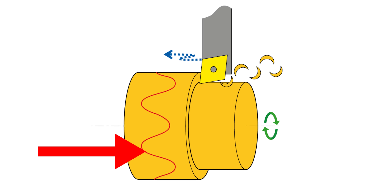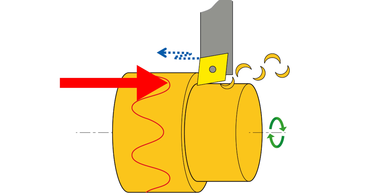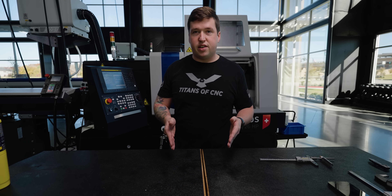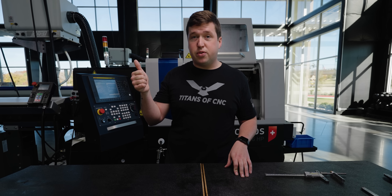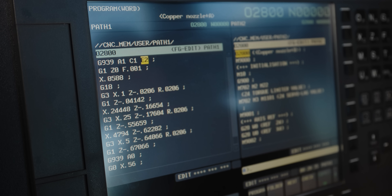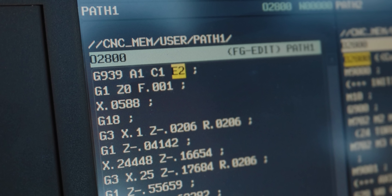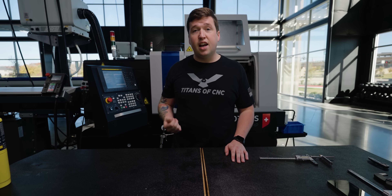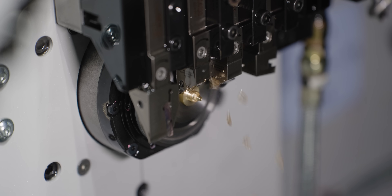I have a C1 in this program, which means it's going to take one and it's going to multiply it by my feed rate to create the size of the oscillation that it's going to do to break the chip. The lower you go on these parameters, the easier it is on your machine and the better finish you'll get. If you jack these parameters through the roof, your part's going to look like crap. The next variable is your E variable — that is the direction you're going to oscillate in. You can oscillate in X or you can oscillate in Z. X is one, Z is two. And because I'm turning in Z, that's why I have a two in there.